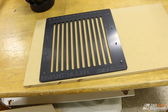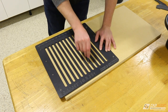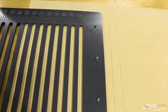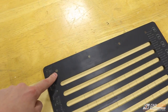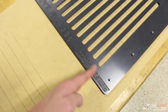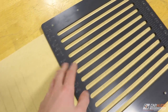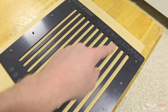As a layout tool, I can use those pins to line up against the edge of the workpiece, and then sketch several different lines that are parallel to each other with a pencil. This gives me a series of lines, and then I can rotate the Smart Ruler. Now the pins are on the other side, and I'm going to sketch another set of lines — but I'm going to roughly judge where halfway is and only sketch lines up to that halfway point, then rotate and put the pins on the other side and sketch those lines.